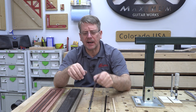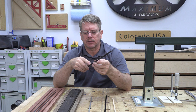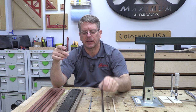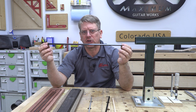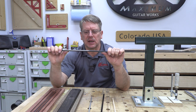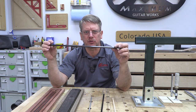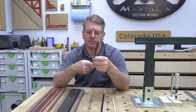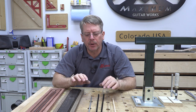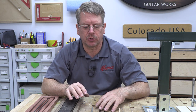There's another option: hollow square tubes with a round hole down through the center. This particular one from dragonplate.com is 0.25 by 0.25 - perfectly square. It's lighter than the solid carbon fiber because of the hollow effect, but the rigidity doesn't feel much different. It feels extremely stiff, returns to zero position, and is a bit easier to install.